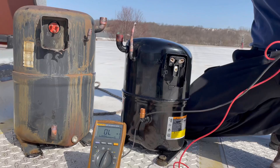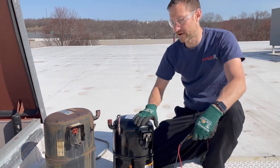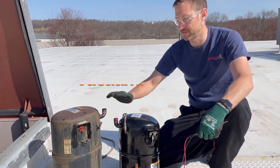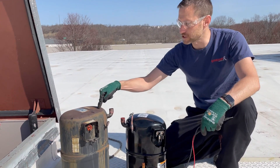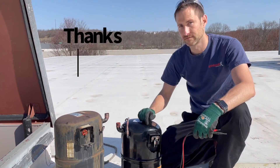That's what you want — to be exactly equal on there, or else you could have a problem with your windings inside. That's just a three-phase motor, and that's one way of checking it. Sometimes they're grounded, sometimes they're open, but end result, this one's bad. This compressor's from 1998, so it's definitely got its use out of it.